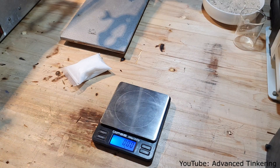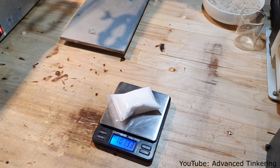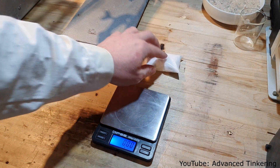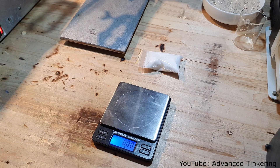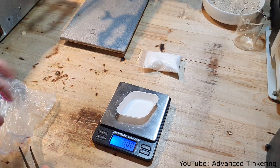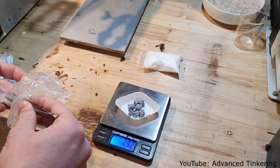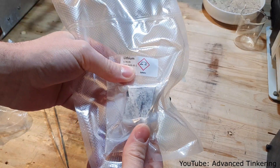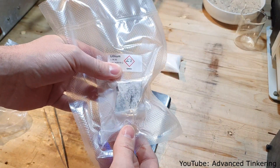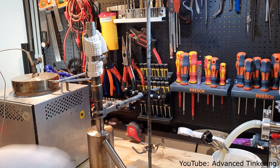Today I will try to make a cesium distillation with around 100 grams of cesium chloride — without the bag it's around 100.40 grams. I calculated that I will need around 4.16 grams of lithium, and I will use a slight excess of 4.5 grams. I weighed out the small lithium chunks, opened up a larger chunk to get a little more, and then filled the lithium and the cesium chloride into my still.